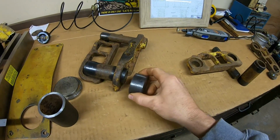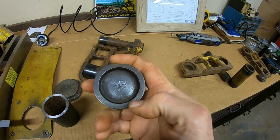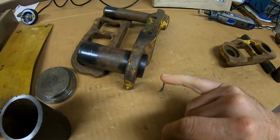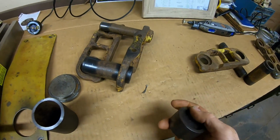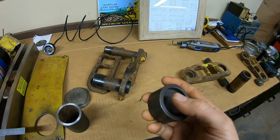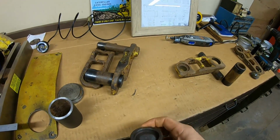First thing is a receiving die. Okay, that's going to go on the bottom, and there's a pocket machined into the face of the die that matches how much distance the bushing is going to have to stick out past that bore. So this is A2 tool steel. I flame hardened it so that it would hold up better.